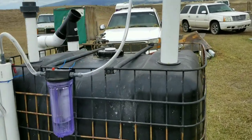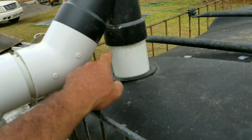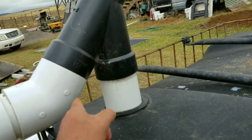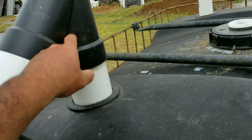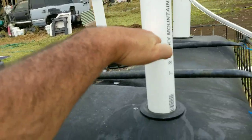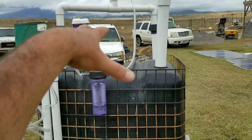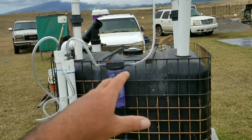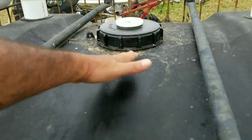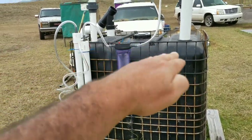The waste port has to be higher than the tank. When filled, the water line is right at the point before it falls off and comes down the tube. As the material inside breaks down, if you're not feeding it, you'll notice the water level drops slightly and the top of the tank goes from bowed — because of water pressure — to more flat, as the internal water level drops to match the top of the tank.